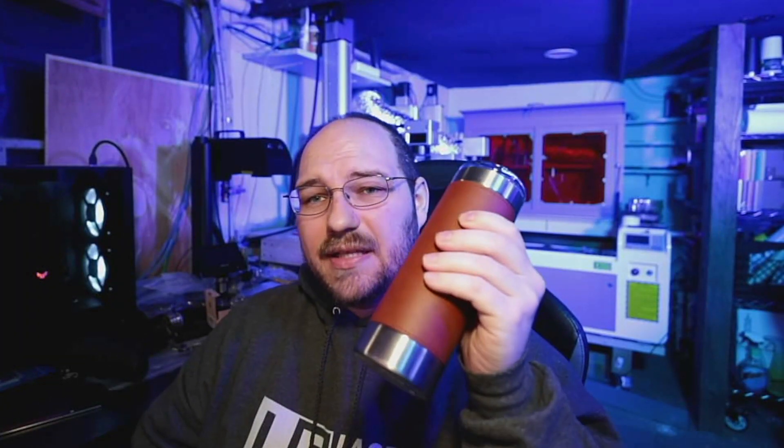The project I'm having a little bit of trouble with is engraving on some leatherette tumblers. Leatherette is a sensitive material and it can be very sensitive especially if you're in and out of focus. So far any of the projects I've shared on stream or in videos have mostly been with a 110 or 200 millimeter lens. We're going to go up to a 300 today. I currently have a 500 millimeter tower and a 300 millimeter lens. That lens has a focal distance of 463 millimeters. Some quick math dictates that only gives me about 37 millimeters to get something in focus underneath that lens, not accounting for any other variables.